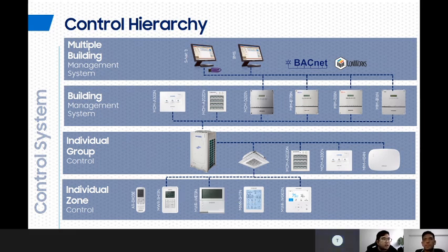Basically, for power monitoring, we will need to have another device. We call it the PIM module, similar to our DMS. That one will be connected to our DMS. If you want super accurate power monitoring, of course you need to have a power meter on every indoor unit. But when we are talking about a VRF system, usually the most consumption will be on the outdoor unit. Based on our experience, most of the time we put the power meter at the outdoor unit only. So yeah, we can also do the